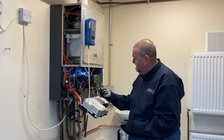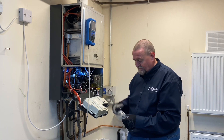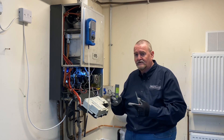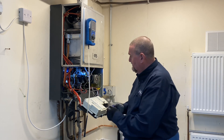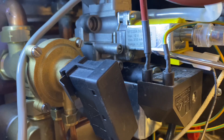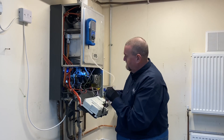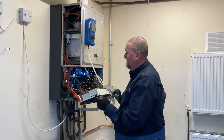At this stage I'll be testing the test point to make sure it's not leaking. I could use LDF but it's close to electric, so I personally use a little gas sniffer - quite readily available. There's nothing wrong with using LDF if you're careful. The next stage is the burner pressure - I'm going to slacken off the top screw. I don't need to turn the gas off because if the solenoid's not open on the gas valve, there's no gas going to get to that point.